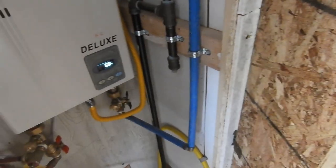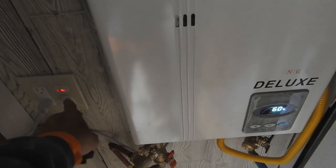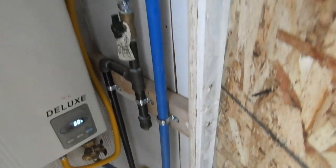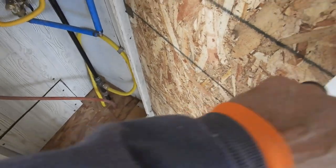This is the water closet. Now the hot water heater — it's tankless now. It's a tankless water heater, and this little switch here turns the heat tape off and on outside so they don't have to remove skirting or anything anymore. That's GFI. Got an access panel here — I just forgot to screw this back up. This goes here like that, and then I made that long one that comes out. That's how we designed it — easy access to that water heater now. No more worrying about that, throwing a bunch of insulation around it outside and everything. That's a lot better system.